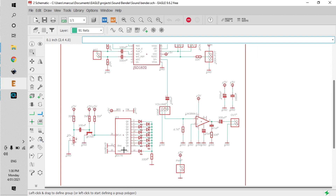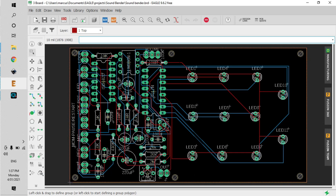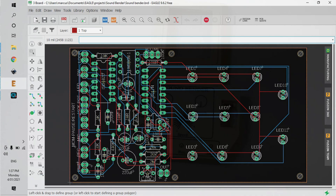And then lastly we've got the flashing LED circuit here — that's one I've done before in the past and I just copied and pasted it over. It's not connected to anything obviously, I'll put that onto a PCB. So these are the LEDs here — there's 11 of them — and that will shine through the screen on the case. The screen kind of finishes around here, and all this will be behind the case so you won't see it. This will be sitting as far down on the bottom of the case as possible. The LEDs look cool if they're away from that lenticular lens which is in the case, so I'm going to lay it flat onto the base of the case. Behind here though it will be a speaker, so I can't lay it dead flat, but it's just gonna be a very flat speaker anyhow.